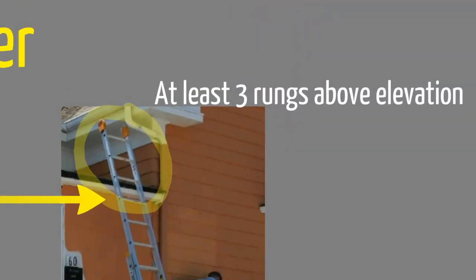Another thing to consider when you set up a straight ladder is the height of the ladder. When portable ladders are used for access to an upper landing surface, the side rails must extend at least 3 feet above the upper landing surface. When an extension isn't possible, the ladder must be secured and a grasping device, such as a grab rail, must be provided to assist workers in mounting and dismounting the ladder.